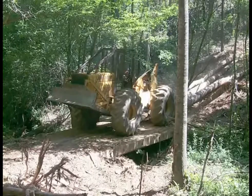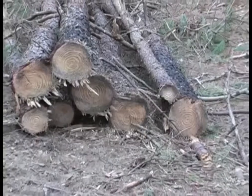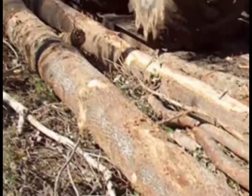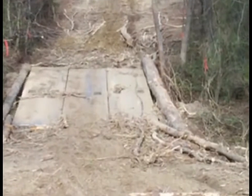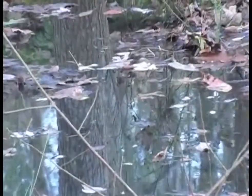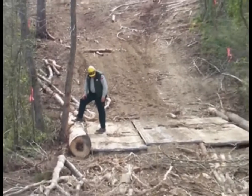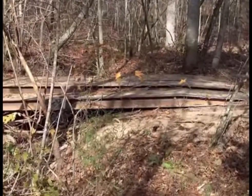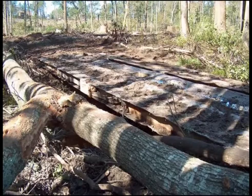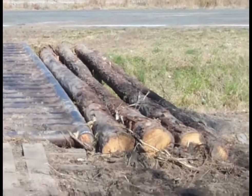In addition to the bumper trees or guide trees, it may be helpful to create a side barrier along one or both sides of the bridge mats by using de-limbed and topped logs. In some cases, you may be able to lay down a large log on either side of the bridge mat and chain it to a bumper tree on each side of the stream channel crossing. This side barrier log helps to keep the logs and trees from rolling over the edges, thereby keeping debris and dirt out of the stream channel. During the logging operation, it is very important to inspect the bridge mat on a regular basis. Make sure the bridge mats are on solid footing and have not shifted. Keep an eye on the bumper and guide trees as well as any side barrier logs. Make sure they are still sturdy and won't pose a hazard by snapping or breaking in two.